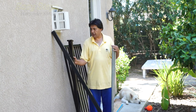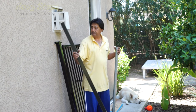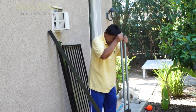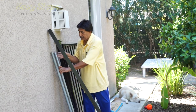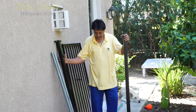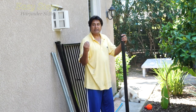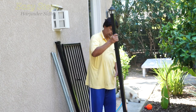I'm going to put the post on the concrete outdoor holes. This is a six-footer. I have the pole digger and I dug it good enough — two feet deep. I'll put my post down here and that will give me level. Now I'm going to pour the concrete, which sets up really quick and fast.